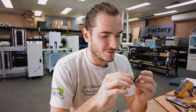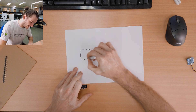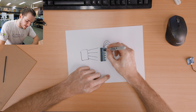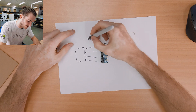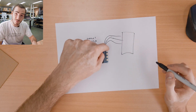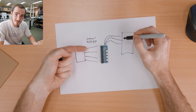That's a lot of pins — something like 20 pins where you need to check both in and out. This might be a good candidate for IO expansion. If we have all the necessary pins on the header driven by one IO expander, and on the bed of nails another IO expander connecting to all the breakout pins, all we have to do is write the whole port with binary data — each pin by itself, so the first pin might be 00001, the next 000010. When we read on the other side we're just checking that the port value matches what we set. Any inequality means a pin is either not connected or there's a short somewhere.